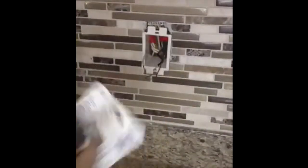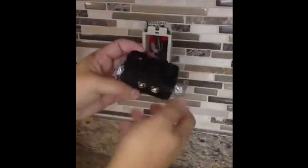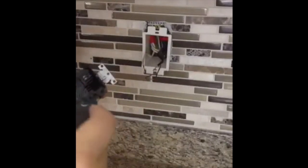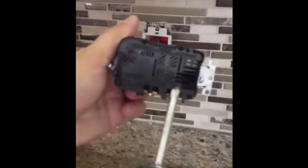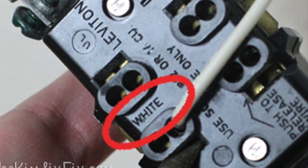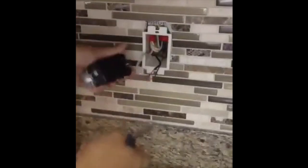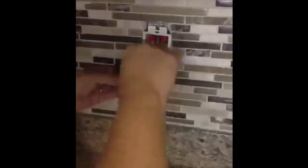These outlets have two options: you can either wind the wires all the way around the screws and tighten them down, or they have this really cool feature like an alternative quick connect where you can just stick the wires in the outlets and screw it down. In really tiny words it says 'white' and 'hot', so you want to make sure you put the white one in the white side and the hot one in the hot side. Connect it really hard — not crack-the-plastic hard, but pretty darn hard.